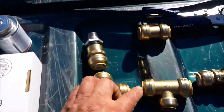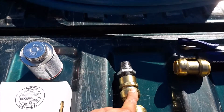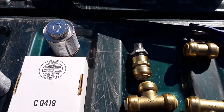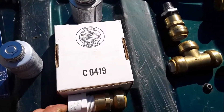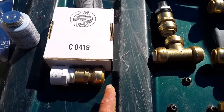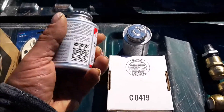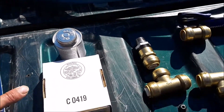From this T, we're going to go to another T that's going to have a one inch outlet feeding about 100 feet to the connection that's going to supply the water to the barn. We didn't have this before, but we thought it would be a worthwhile investment. From the other end of the T, to a SharkBite fitting — about three feet — this fitting will connect to the one inch PVC on the house. We got the best quality thread sealant we could get, and a simple PVC tubing cutter.